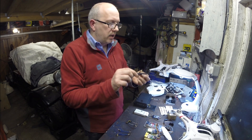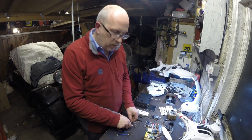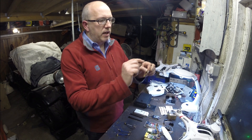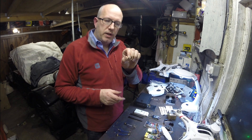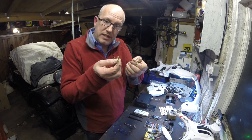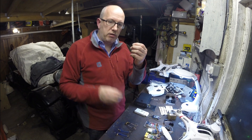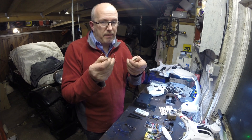So how do you get around this? Some clever guys online said, well, if we had circular polarization, it wouldn't really matter if you were tipped over. So that's precisely what they did — they got small sections of aerial at the right angle and then twisted them. This is a left hand polarized antenna, and this one is a right hand polarized antenna. Just in the same way that a vertically polarized antenna doesn't see a horizontally polarized one, left hand polarized doesn't see right hand polarized.